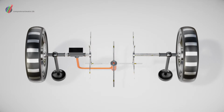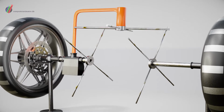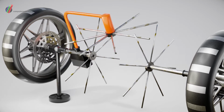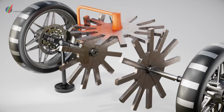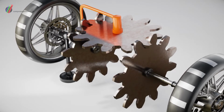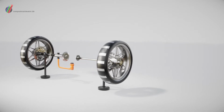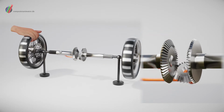To adapt the model for use in an automobile, we will have to make a few changes. In order to reduce the jerky action caused by wide spaces between the spokes, we will put in more spokes. Further filling in the spaces between the spokes gives steadier, more continuous action, and changing the shape gives firm, constant contact. Now we can make the gears thicker and stronger, and we have differential gears. The edges are cut so that they will fit together more smoothly and silently.